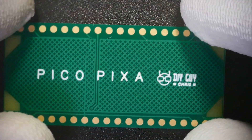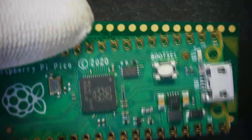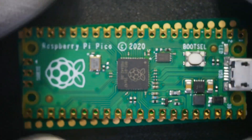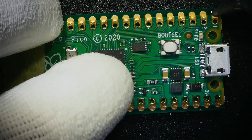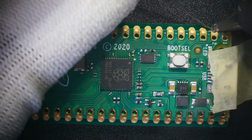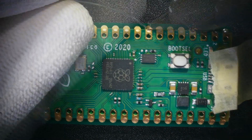It's also necessary to use the appropriate tool set for rework, like flux and solder wick. After getting all the pixels properly assembled, I moved to the top side to solder the Pico board to the host through the castellated edge pins. This was my very first time assembling such pins and I find them very handy and cleverly designed headers.